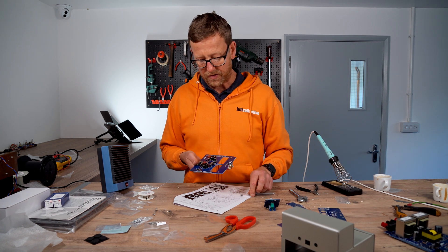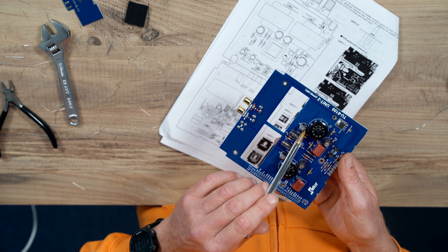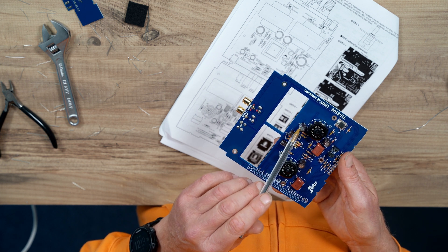I'm just going to do a quick check to make sure I've got the electrolytics the right way around. I'm looking for the positive — it's not near the white bar end.